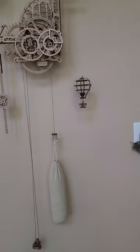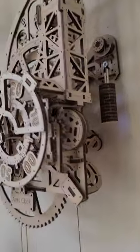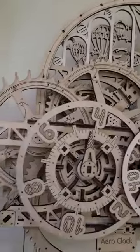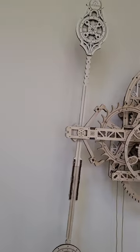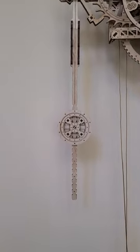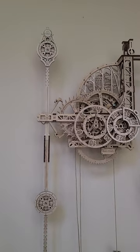The general way this thing works is you have a bag of sand. The bag of sand pulls a wheel, which turns a bunch of gears that keep time. You have an escapement wheel here which makes a rotation every minute. You calibrate the pendulum to make it do that — you have these weights on the pendulum that go up and down, and you use a stopwatch to make sure it keeps time. It actually is quite accurate.